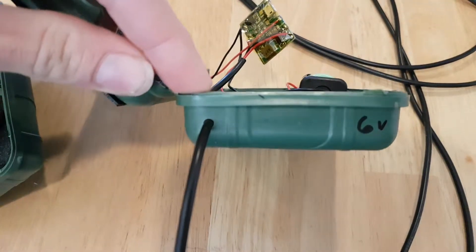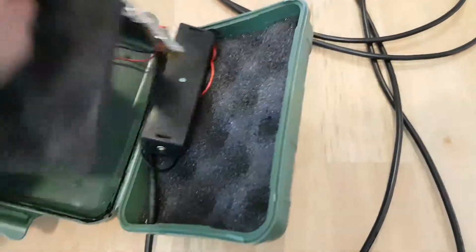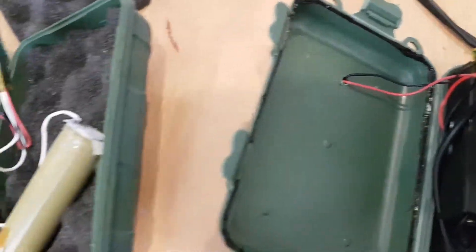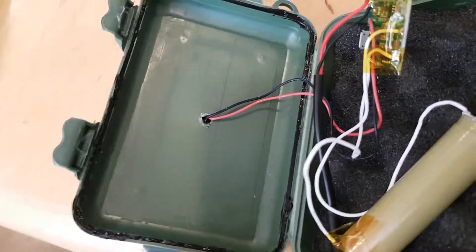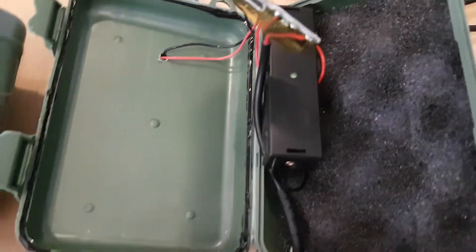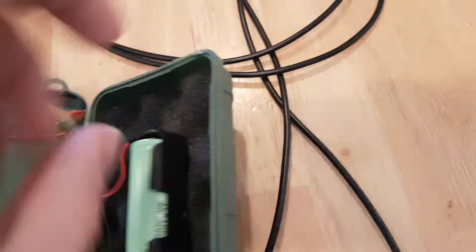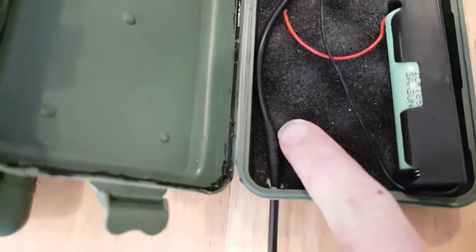I also drilled out these holes, which is just faster, easier, smarter anyway. I soldered out that hole, so that really cleaned that up. You can see the 6 volt setting here — I have it set for 6 volt output. I also drilled out that little hole on my original boards too, where I used the iron and melted the hole. I used a little bit of heat shrink tubing to help keep the wires from trying to slide out.